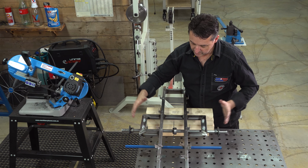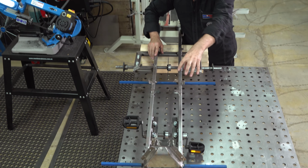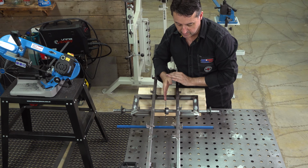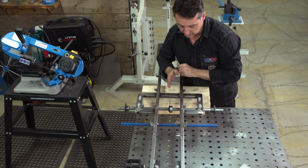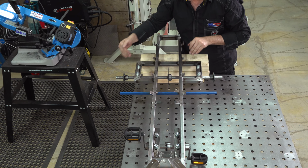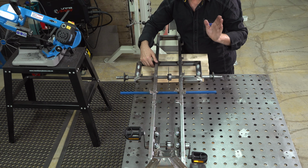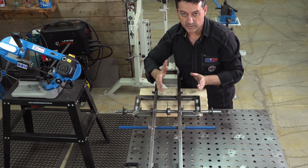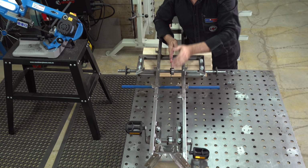We've assembled and bolted our rear axle. We've done our front crank. We've also pulled the adjustment back because the next step is going to be set the chain. Notice that we've also got central alignment on the front drive sprocket and the rear drive sprocket. These, the keyways, etc., are offset in their machining as per the drawings. Same for the front crank. You need to make sure that you orientate it correctly so it all drives through the centre of the chassis.